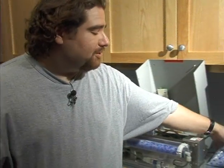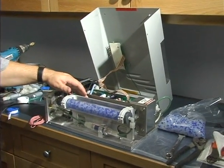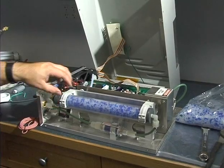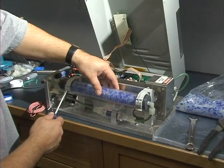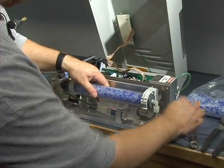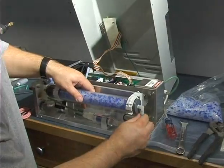Also included in the maintenance kit are silica gel crystals for the indicating chamber, which gives us a status for the air dryers. This doesn't quite actually need to be replaced right now, but we'll go through it just to show you how. First, loosen up the clamps and go ahead and take this fitting off — most of these fittings are just a little past finger tight.